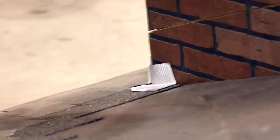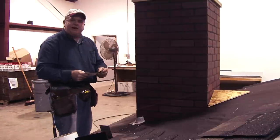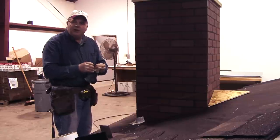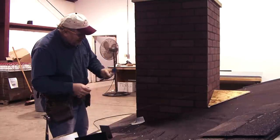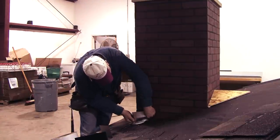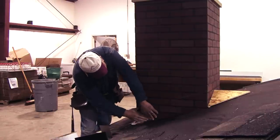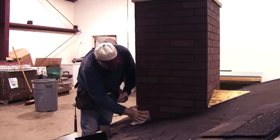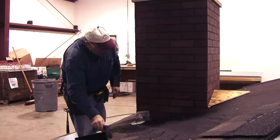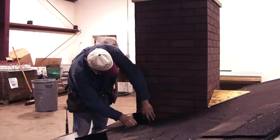With that in mind, I'm going to take a piece of house wrap sealing tape — commonly used with house wrap to seal around windows. I'm going to put a piece right here before we put the next step flashing on, going right around the corner. That's going to effectively raise the flange on that corner shingle. Then we're ready to install our first piece of step flashing.